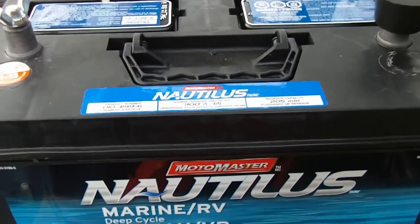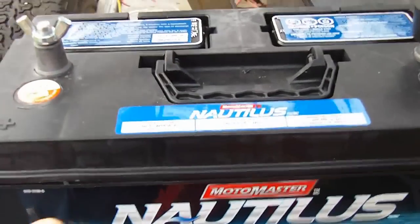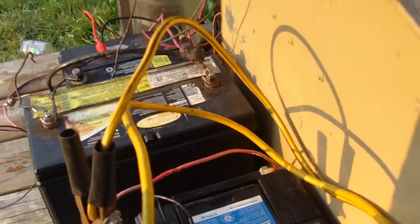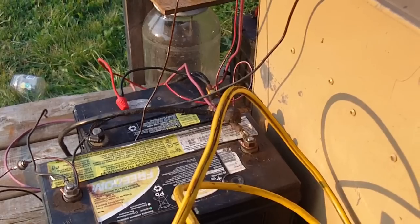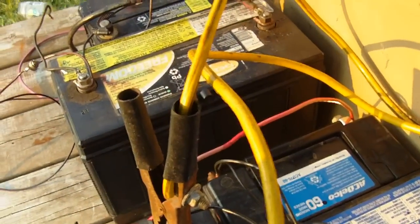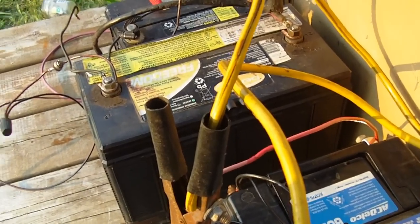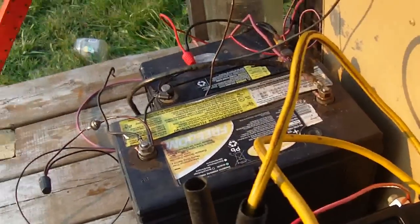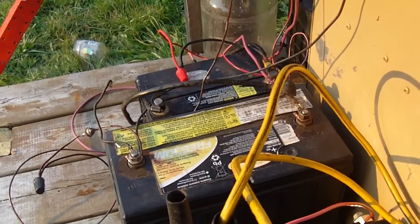I just picked up a deep cycle battery for the system here, and this is perfect — if you bought a couple of these to connect into your solar charging station it would work well. If you're going to be using this on a day-to-day basis, you're not going to want as many batteries because you're not going to be able to charge them all up. You're better off with maybe two good deep cycle batteries, or four maximum. But if you're going away for a week, you can charge up as many as you want — just calculate at least 2 amps per battery.